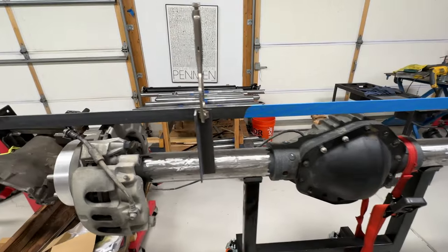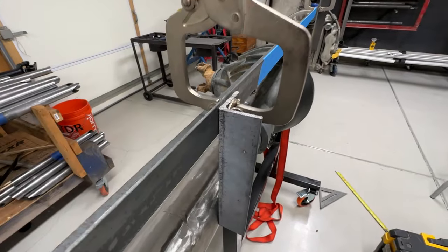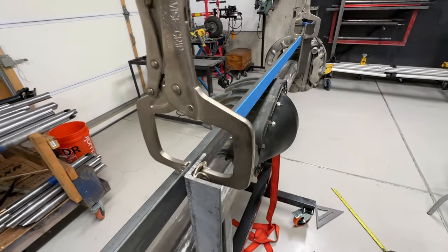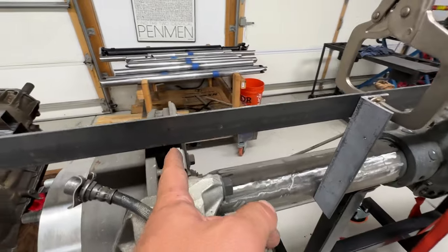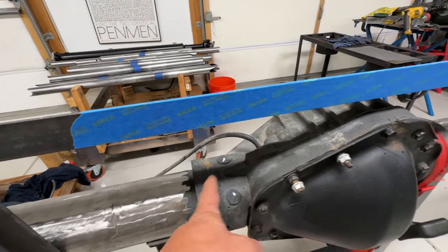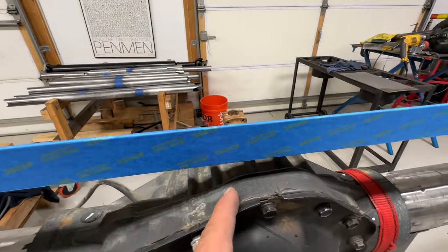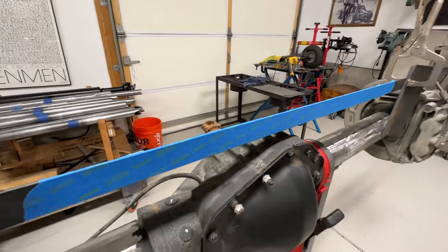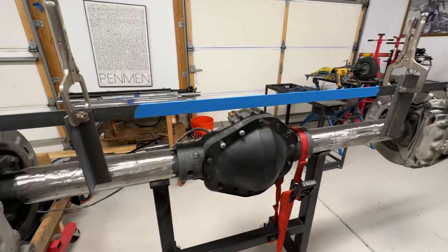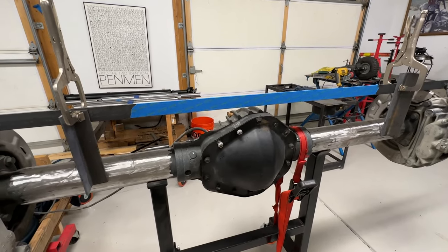What I'm doing here is I've got a couple pieces of angle iron set across the back. I've got pieces that basically keep us normalized — tangential to that tube down there. I'm going to start over here and mark this point as my zero, then mark right where it makes a step up and mark all the different profile changes all the way along. I'll measure the distances on those profile changes, giving me an X and Y axis I can put into Fusion 360 to start building this truss.